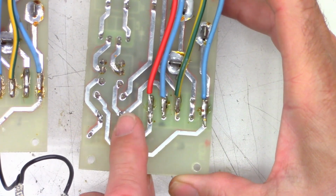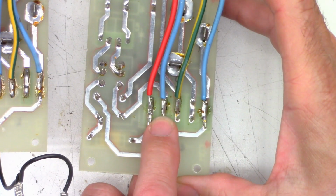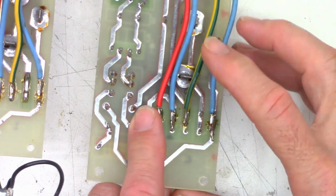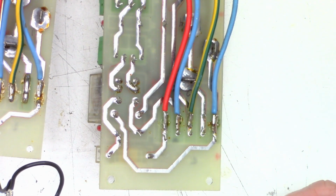But I think I just want to go ahead and apply 240 volts between these two pins. And then we will trigger this pin with that said 240 volts and just see if these time delay relays are doing what they are supposed to do. So let me get a transformer. I've got an old control transformer in the garage that was meant to convert 480 or 240 down to 240 or 120, depending on how you wire the inputs and the output. So what I'm going to do is wire the output to 120, and then I'm going to reverse supply this transformer with 120 volts. I'll wire the input to 240, and we should get an isolated 240 volts into these boards. So let me go grab that. We'll get it fitted, wired up, and I shall be right back.